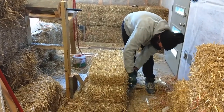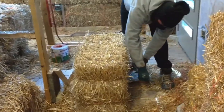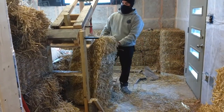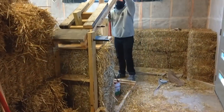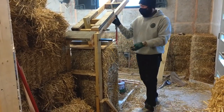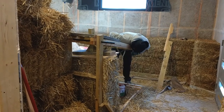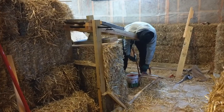Here's a quick demonstration of how to use the straw bale squisher. I built it basically from a picture I found on the internet — it's very jerry-rigged. You put some string around the straw bale, place the bale in position, and take out the piece that holds the lever up. If there's not going to be enough compression, sometimes I'll put pieces of wood in between the straw bale and the squisher. We use a ratchet strap to hold it down.